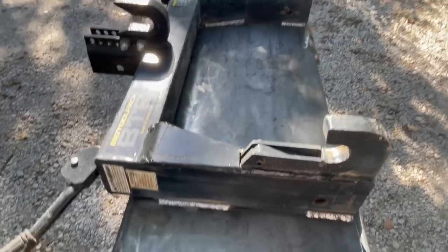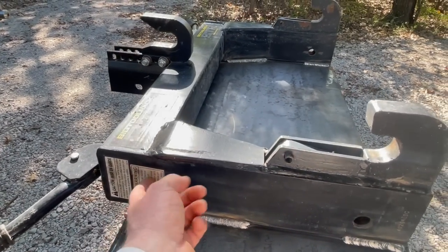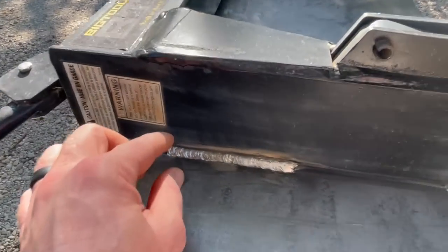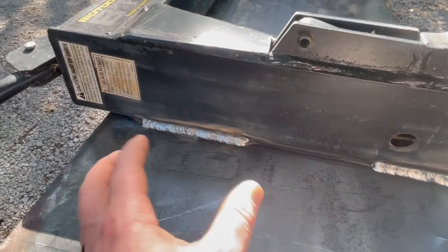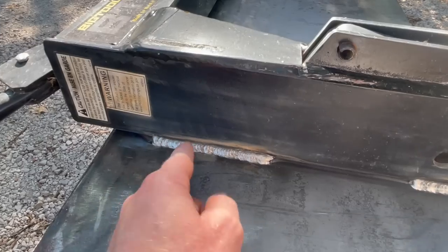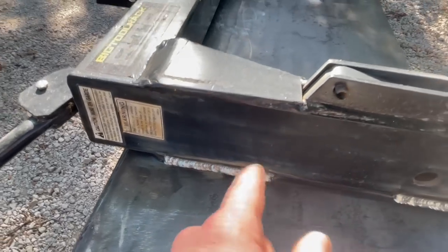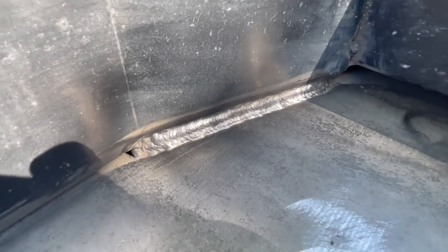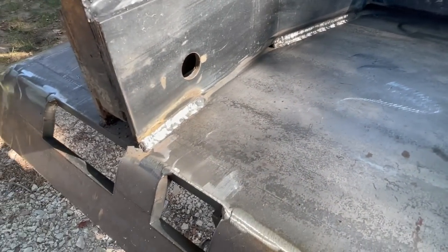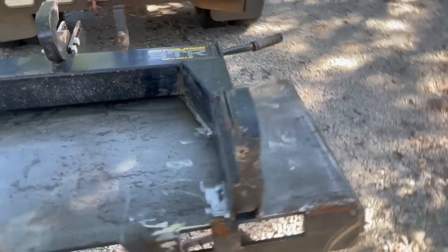All right, that's a done deal. Right here, because there's a plate welded on the bottom, I tried to do one pass and I could have probably made my machine a little warmer to help fill that in more, but it just wasn't welding great. On the other three I just put two passes on top of the 6010, and that just welded a lot better. Down here I just put one pass, but anyway — there you have it.